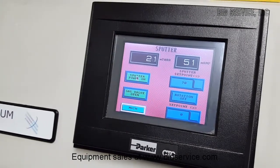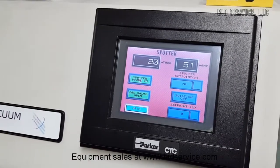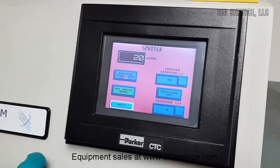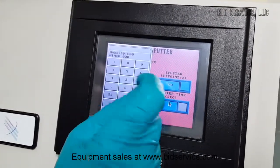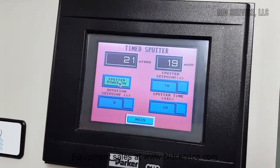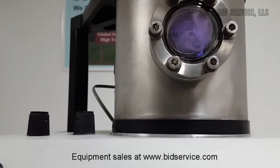You should follow the manual instructions in order to operate this machine. The system chamber should be cleaned periodically to eliminate any contamination. I am going to turn off this and go back to the main screen and do a timed sputter. I am going to select time as 30 seconds. Right now it is time sputtering and the gas valve is still open. The sputtering has started again, but this time at the end of 30 seconds it will stop the process.